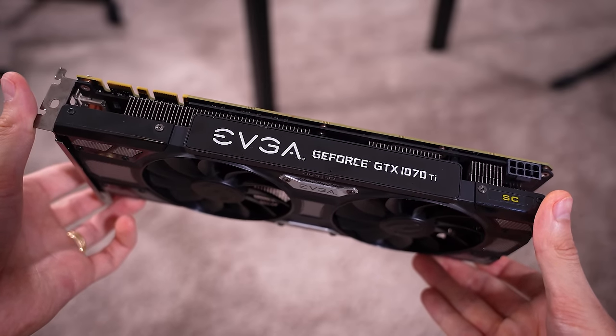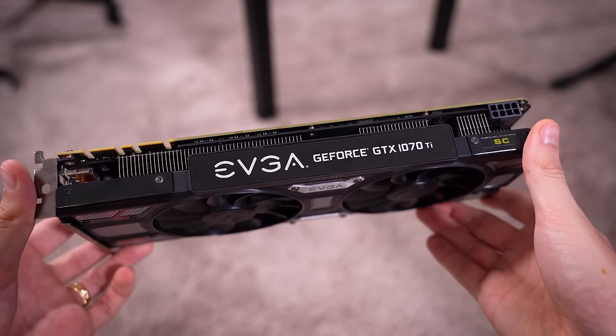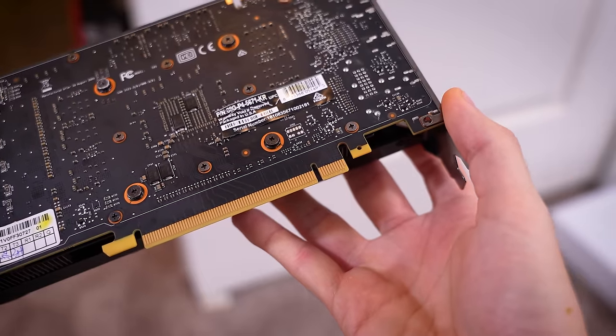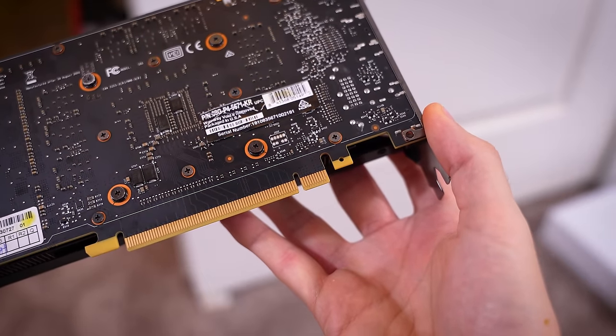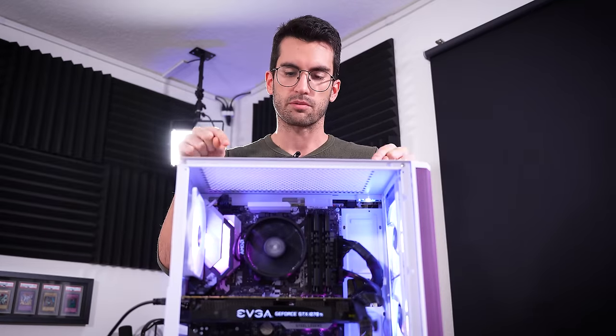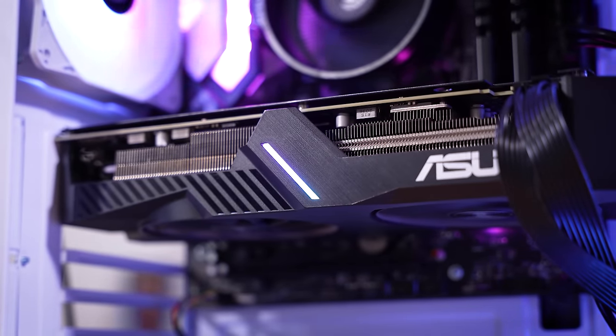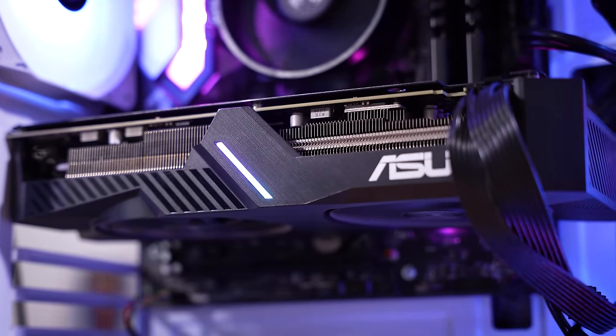I hate to use the word certain because in science there are very few certainties, but I feel like we've exhausted every feasible option here. We could start probing SMDs on the board, trying to find dead shorts or partial de-ballings, and yes, we could blast the card with a lot of heat and just cross our fingers — but this isn't my rig. This is a viewer's rig and I want to treat it with respect. I don't want to send them back with a card that might only work for a few extra days. Those heat treatments — toss it in an oven, et cetera — tend to be temporary solutions. I want to make sure they're equipped with a card that is presumably going to last several years, and that is why I am avoiding the heat treat method.